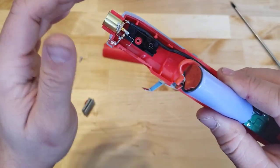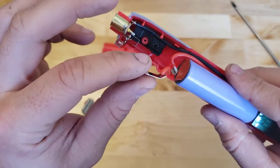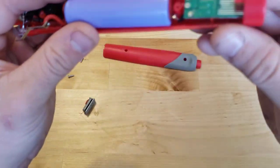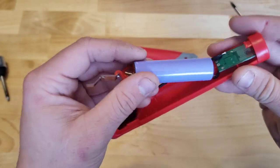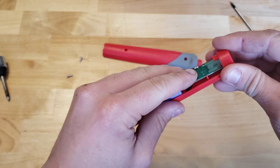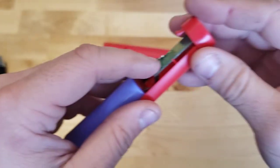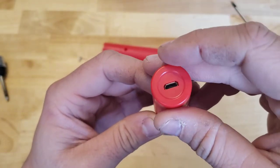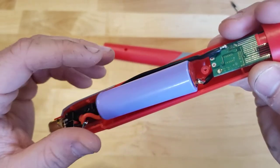You can see it's just got a couple of plates soldered onto the 18650. This is the output lead here that goes to the little switch. This is the piece that goes down to the charging component here. It is kind of stuck in there, but I'm assuming that this part down here, all that it is is for charging — so it goes directly to that micro USB. I'm assuming it's taking that 5-volt input, regulating that so that it charges the 18650.